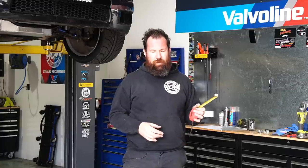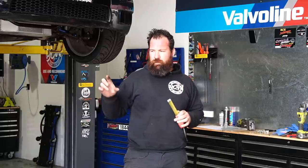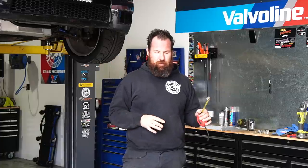So we're going to keep chipping away. We're going to do the final weld on our second side frame. Then we're going to put the two crossbars in to build the top section into a top unit. Then we're going to weld the two socket fittings onto the top once that's assembled, to make sure it's all square. Then we're going to move on to the bottom section.